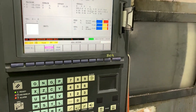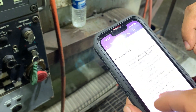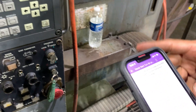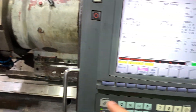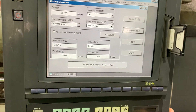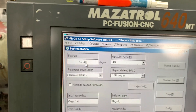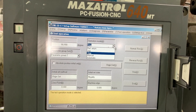Let's review the procedure. Let's do the home position by following this procedure that is in Teams — that is the MRJ2 drive home position set. We need first to unclamp the turret and be on mechanical position number one. Now we have to go to the MRJ2 and select reference return. This should be zero at the end of the procedure.